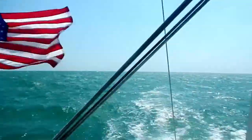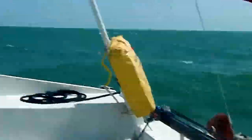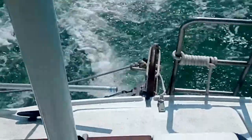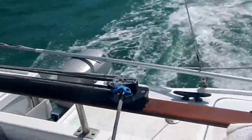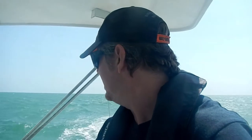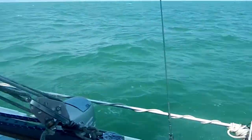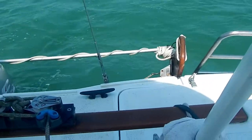Well, that didn't last long. We're down to one rudder. As I feared might happen, the end on that little black plastic piece pulled out of the tube. Now it's just sitting there attached to the rudder cassette, and the tube is just propped up on top of the motor. Only the port side rudder is actually steering. I get some steering out of the starboard rudder when I'm turning to port because the rope is still going to pull a bit, but for the most part it's useless when trying to go to starboard. I managed to bind this end of the pole back, so I'm going to have a little bit more steering again.